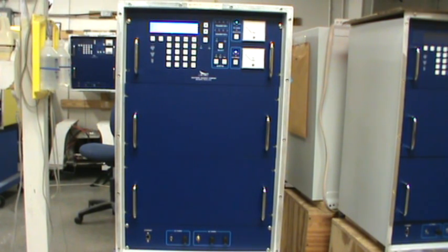The front panel controls on this transmitter include frequency adjustment, which is unique for non-directional beacons. A tone frequency adjustment allows you to adjust between 1020 hertz or 400 hertz. Call sign entry, which supports alphanumeric characters up to 8 characters.